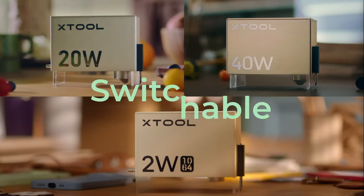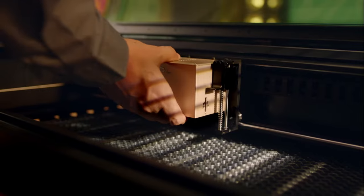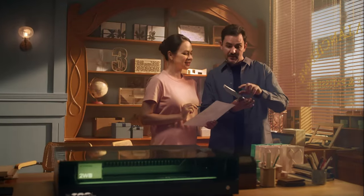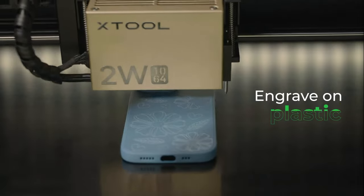What's really cool about the Xtool S1 is that the laser module itself is actually modular. You can get it with a 10, 20, or 40-watt diode laser. I personally have the 20-watt, which has a little bit better focus than the 40-watt — so the 20-watt is better for engraving really good detail, and the 40-watt is better for cutting. You can also get a 2-watt IR laser, which is good for engraving things like plastic. The modular design means you can buy it for one purpose, realize you want to do something else, and just get a different diode for it.